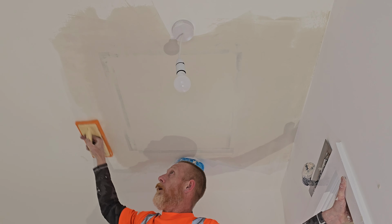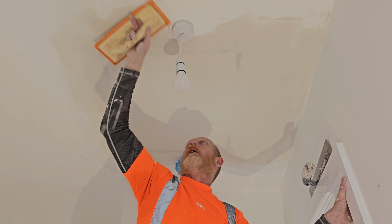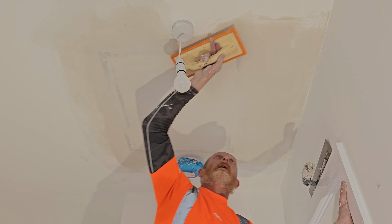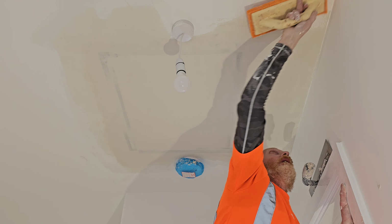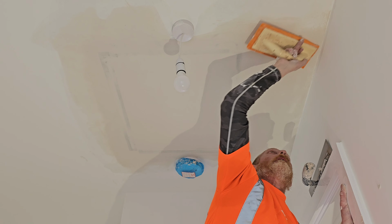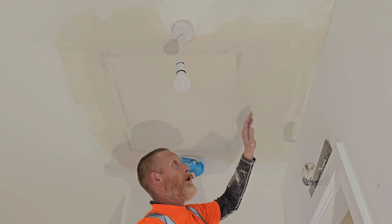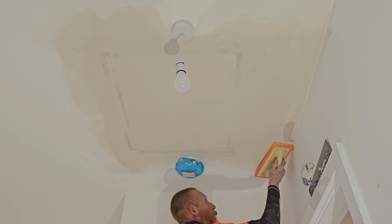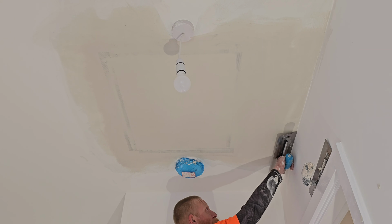We're getting sponge float. And all we're doing, keeping them edges wet and allowing us to get that fine finish that we need. What I'm going to do is I'm just going to run my sponge float across there, just so it's got a little bit of moisture for when I trowel through. Ox Ultra Flex, a quick wipe. Make sure it's nice and clean. We're going to come now, we're going to pass these edges. We're going to have the trowel more on edge.